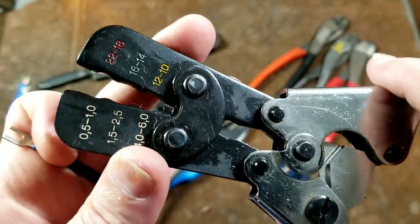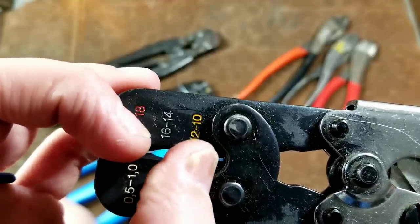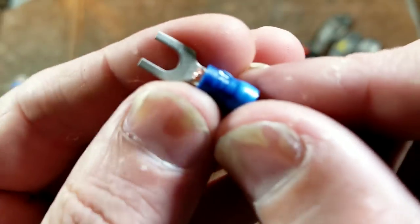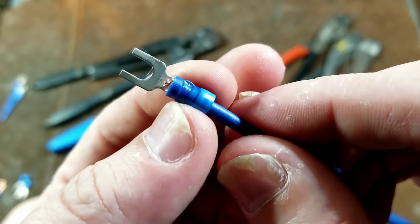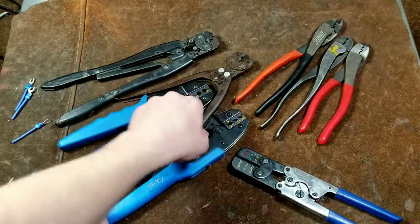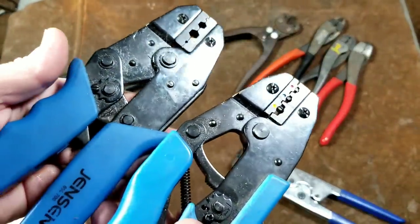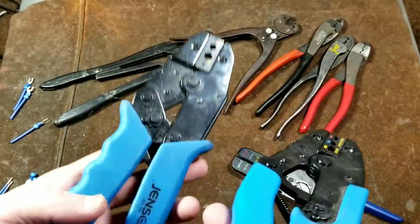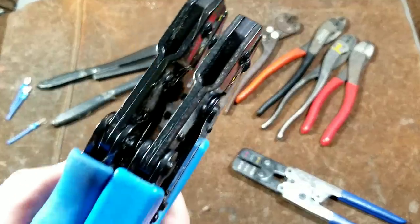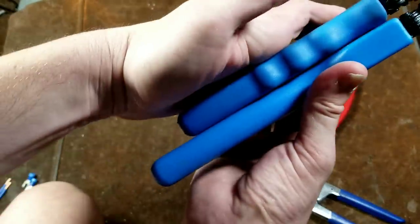With stainless steel wire terminals that are tough to crimp, these bolt cutter style tools provide all that force, but the issue is the elliptical shape — it pushes a lot in the middle forcing terminal and wire to squish out sideways, leaving some air space inevitably. The Amphenol crimpers make a perfect little circle, squeezing out the airspace so the wire is effectively welded to the terminal. I'll compare against these two ratcheting sets — Jensens and Quests, which are like ideal Crimp Masters. You can order these as frames and then order die sets separately.